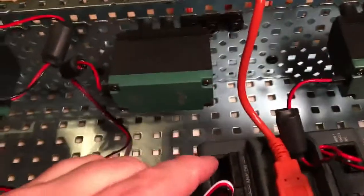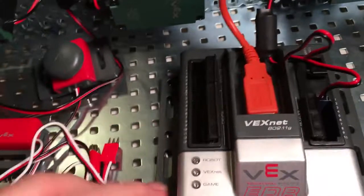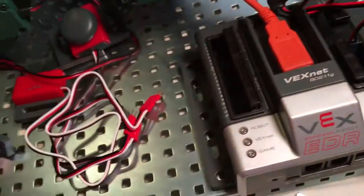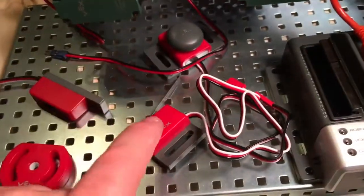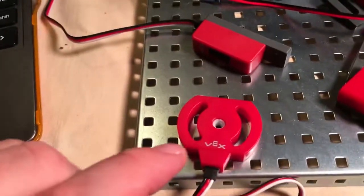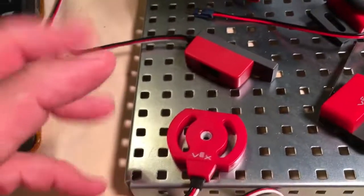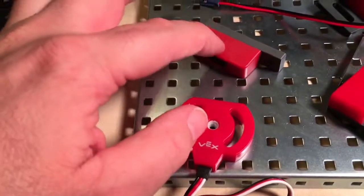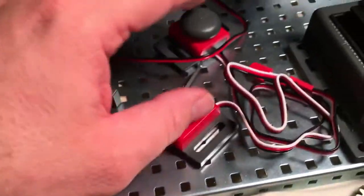The top part of these are for analog. This microcontroller has two different parts: an analog section and a digital section. Digital means zero or one — it's an on or off kind of thing, like a light, a bumper switch, or a limit switch. The line tracker and the potentiometer are analog because they have values that range from zero to about four thousand — we'll have to double check on those. So those two will get plugged into analog, and the bumper and limit switch will get plugged into digital. Doesn't matter which port, and the LED we're going to plug into digital too.